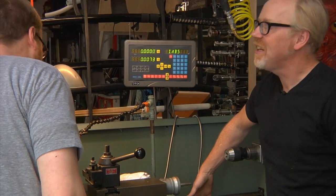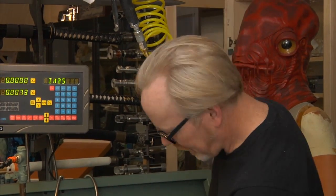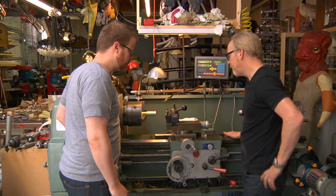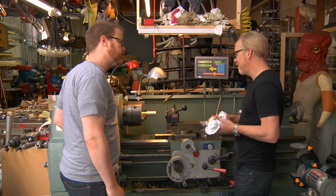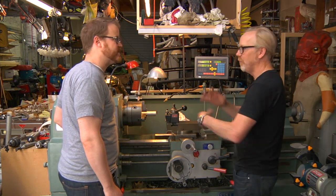I put the 40-inch cross feed out here on the back, bolted to the back. The nice thing about bolting stuff to machine tools is that while the ways and the key bearing surfaces are hardened steel, the rest is all cast iron. They sell the brackets for these with slots so that once you get it close, you can use a micrometer to make sure you've really dialed it in. This took me about three and a half hours to put the back feed and the cross feed in. The cross feed is still unprotected — I haven't yet done any work with cooling fluid in here. I'm going to put an aluminum sheet over it so it's better protected from splashing fluids.